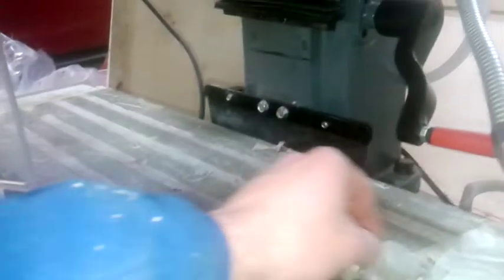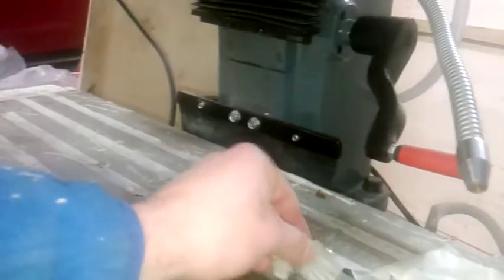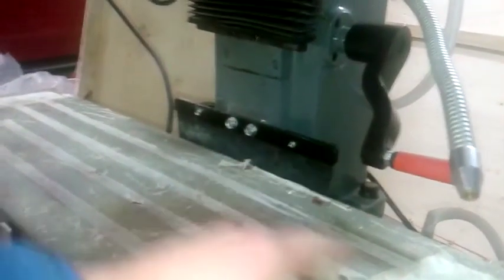On the other side of the cross table it's the same story. Rods and slide ways are painted also, but no grease — apparently grease was too expensive. Good thing is that the surface of the cross table was covered by oiled paper and grease. That is a very nice cover and I will remove it later. The Z-axis spindle scale and handle are in grease — really nice.